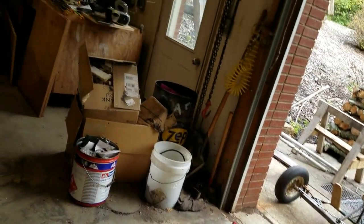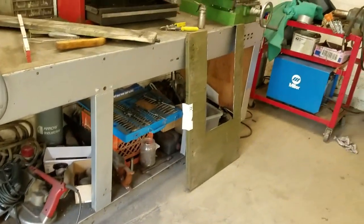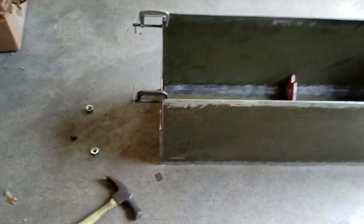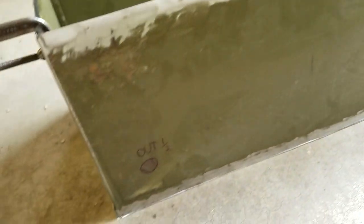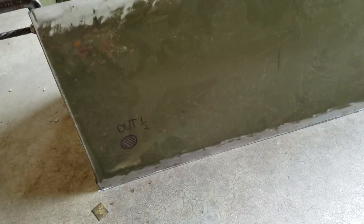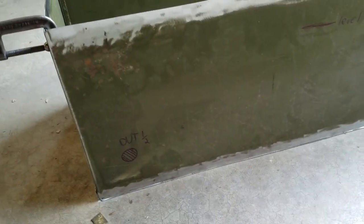It's made out of just some regular sheet metal — actually old metal shelving that I cut up. It's working pretty good and should be nice. The thin walls will help the heat dissipate faster as well. Down here is the outlet, and then the inlet will be up there. The outlet going to the hydraulic pump will be one-half inch NPT size, and the inlet I'm expecting to be three-quarters, just to match the fittings I have on the other parts I've gotten.